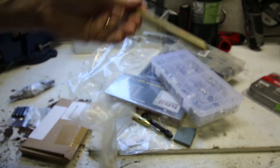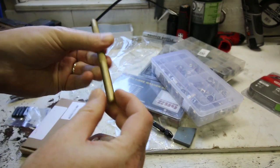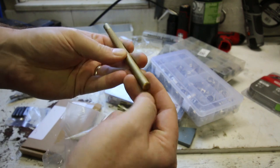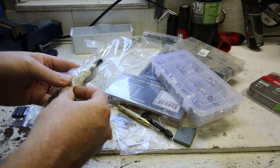And another thing that I lost — my small brass punch. These things are non-marring. You want a brass punch for punching out bearings and bearing races specifically, so you don't mar the steel where the race is set in. Handy to have. I don't know where mine went — it just disappeared.